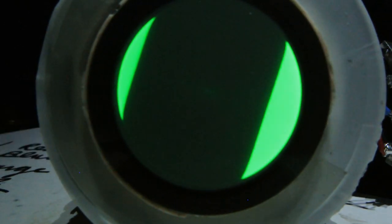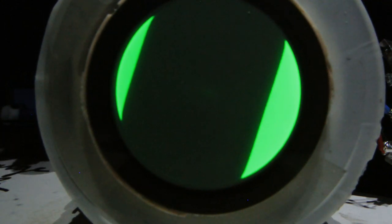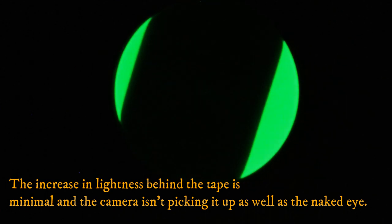Let's watch a little bit of this process so you can see what I'm talking about. I've tweaked up and down on all four of these pots. I've got a piece of tape across the front end with some ambient light in the room to show relative brightness. We'll step through all four of the pots. First we're going to R1 — everything's set to neutral the way it was when I pulled it apart, gains all the way up on this device. When I mess with R1, going clockwise up, that is brightening up the area behind the tape — that would be your pitch black darkness kind of. And if I take it down, it does impact everything at the high end. When I had the gain way down, R1 really didn't do much — but it affects the high end and the shadow detail.